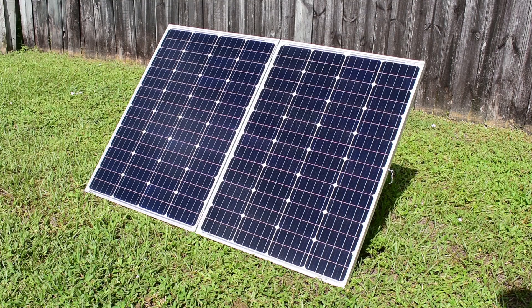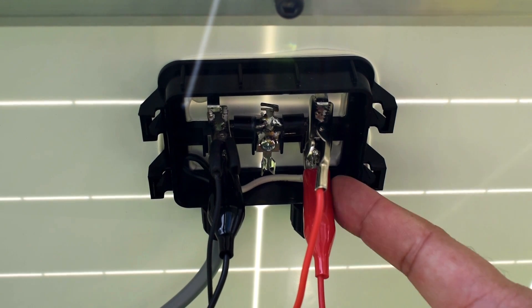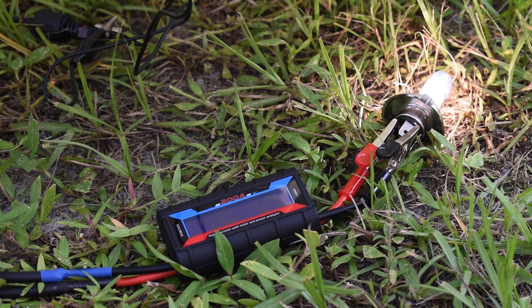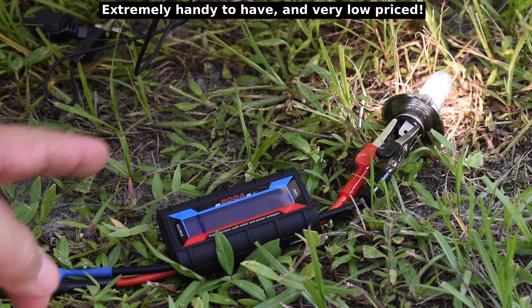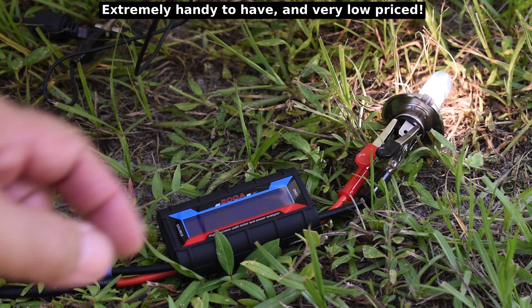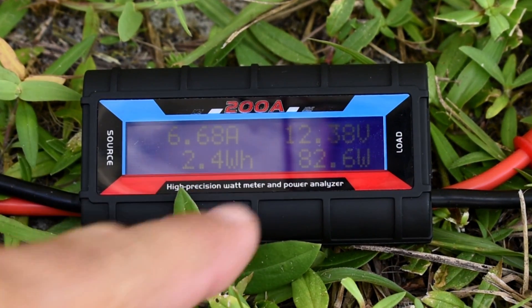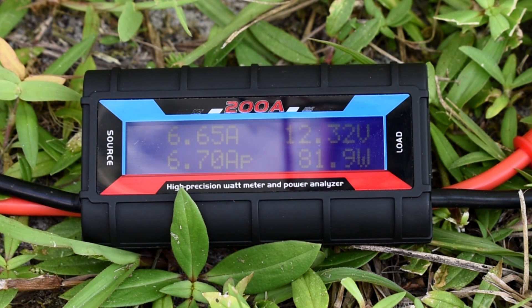We're going to do multiple tests for power output. I popped open the cover on the diode box of the left panel and tapped directly into the positive and negative terminals — there will not be any blocking diode in series with the power meter. To ensure the current can be handled, I used two wires on each side. The power meter is connected to the terminals of a halogen lamp on the high beam terminals. The reading shows 82.4 watts at 12.38 volts.